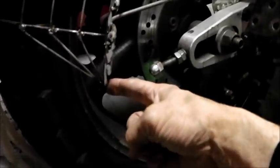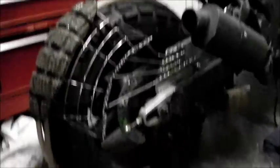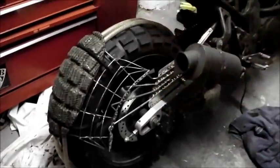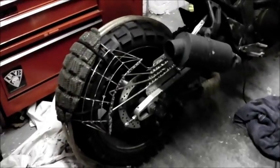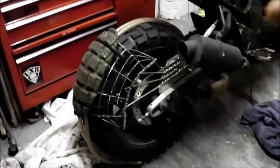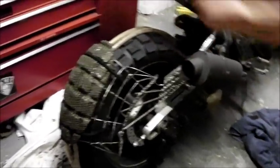I'm going to roll one inside as a brace, and probably brace up the inside of the sheet metal later on, just to make it strong enough to take whatever flexing comes in the future — though I may wait to see if it needs it first. That's the main construction of the right-hand side. I can do the other side tomorrow night and then it is welded into one lump. After that I just need to take it off, clean it all up, brace anything that needs it, and adjust anything for symmetry. Then paint it.